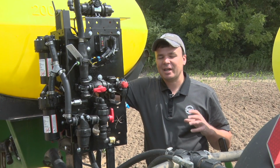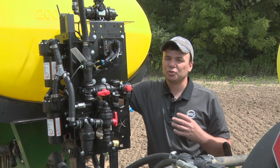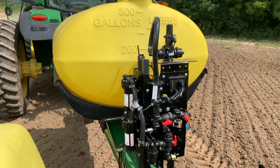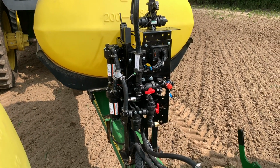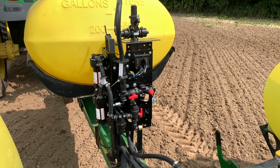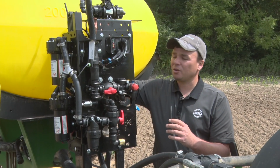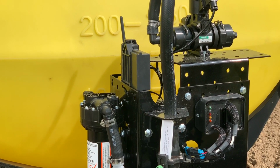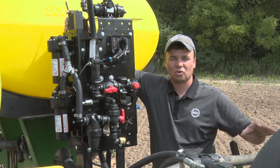So for 360 Dash, it's important that we have consistent pressure at every valve. To make sure that that's going to happen, we've worked with AgExcel to design 2 different pump towers, one that's electric and another that's hydraulic pumps, to be able to provide the pressure throughout our system. Then our center hub is right here on the edge of the tower, and we use this as our master controller to control both the pump tower and send out the commands to all the rows.